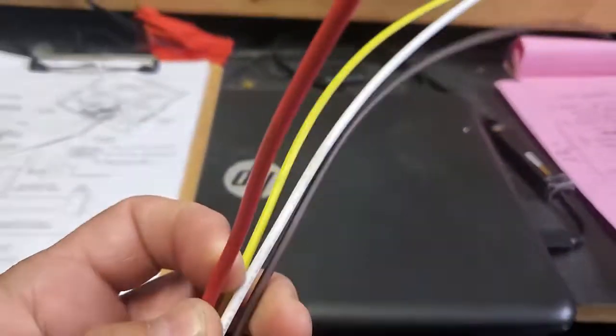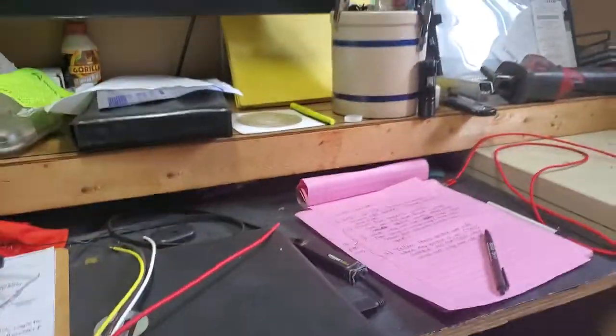That's the first place to check. A good indication that you are getting some power: if you open your door and see the little yellow light underneath working. Some of you don't know it's under there because the bulb's out — put an LED bulb in it, a little less drain on the system. If you don't see the light coming on, it could be a bulb, a module, no bulb at all, or you're missing 12 volts. You'll have to climb under there and do a 12 volt check on the red wire with the house connected.